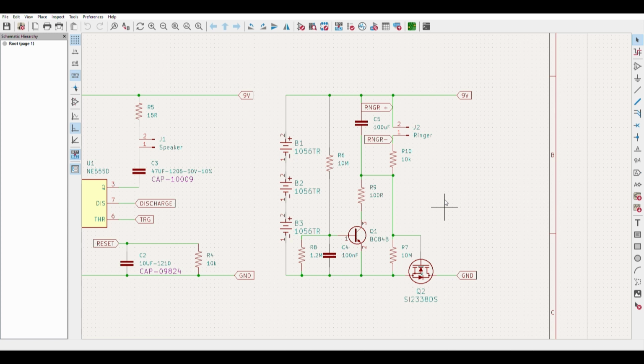And pretty much this continues to happen every time you press the button to ring the doorbell. You press the button, doorbell rings, connects power. So if someone then comes along and presses the doorbell again within the next few minutes, it will ring and restart the on timer. But once the doorbell has been rung, power is cut and the battery is being saved.